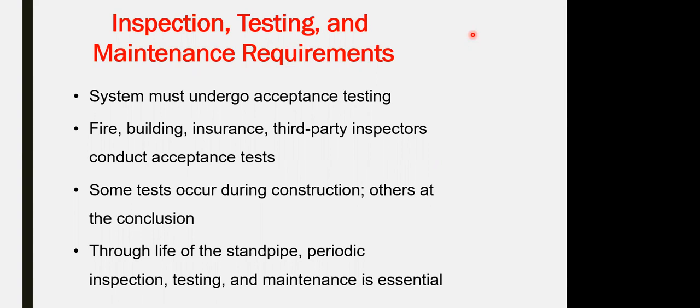Okay. So what you need to do is go through this manual of testing and commissioning, not only for the exam but for your maintenance and operations as well: testing and inspection, periodical test and maintenance. You should know what is going on. For the exam, we have the NFPA. We explain it here, and whatever differences there are, highlight them. In the exam, you have to answer according to the civil defense itself, not according to the NFPA, if there is a difference. For example, NFPA asks for testing every 6 months for one item; civil defense says every 1 year is okay. Answer according to civil defense. There are very few areas where they differ.